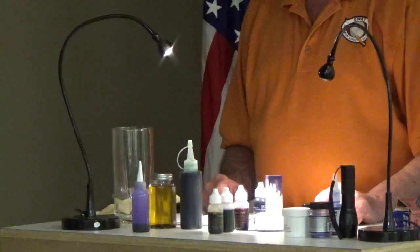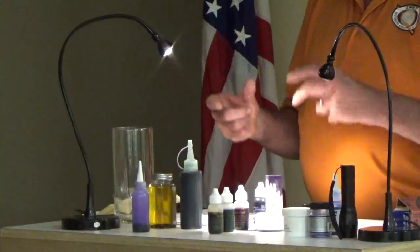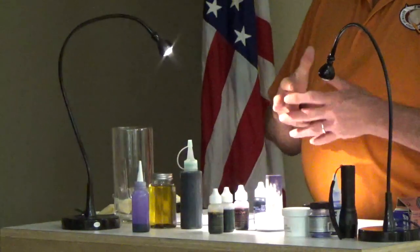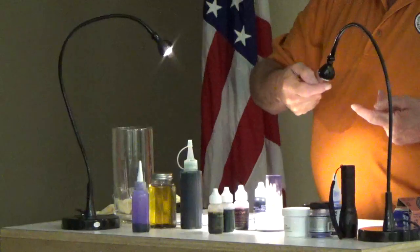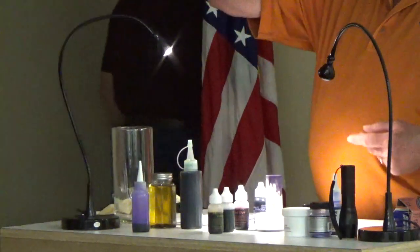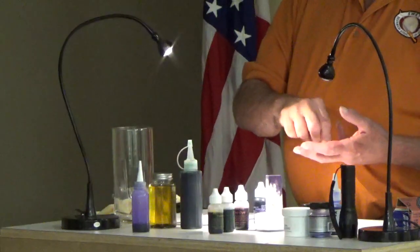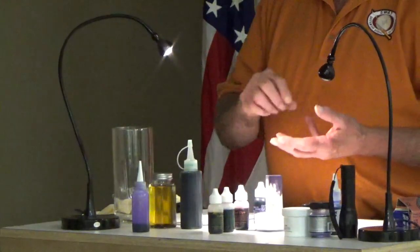I've heard it done, I've not tried it. Just take white blanks like ash. Don't just dry them out 100%. Put them in the tank, draw them to a vacuum for several hours without anything in it, with no resin. What do they call them things that they use in medical stuff to hold the liquid? Not a syringe. Pipette. Take 3 or 4 pipettes, put them in between your fingers, get different colored resins in them, quickly take them blanks out of the thing, put them on your piece of aluminum foil, start squeezing them things.